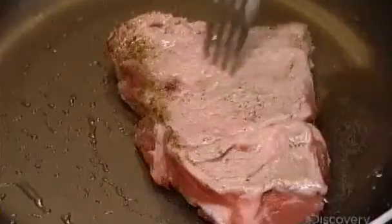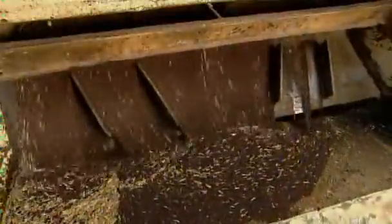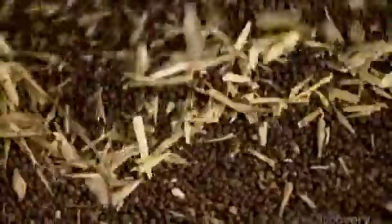When the canola seed arrives at the processing factory, it contains foreign material, mostly plant pieces. So the first step is to clean the seed in a vibrating sieve. The seeds, smaller than the openings in the sieve's mesh, fall through to a conveyor below. The foreign material remains on top. A conveyor moves it to a storage bin where it's collected for sale as cattle feed.